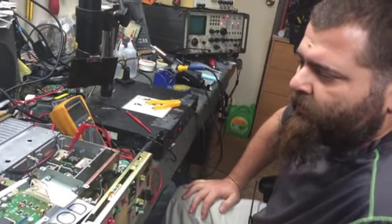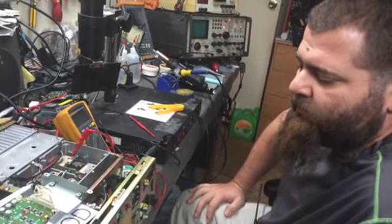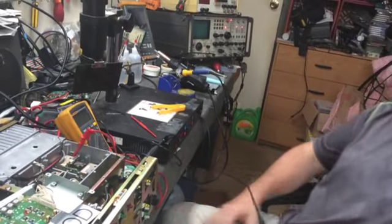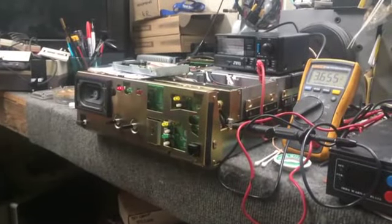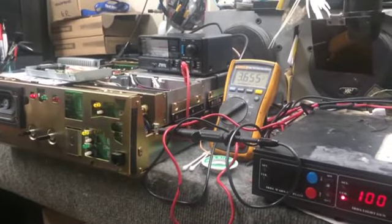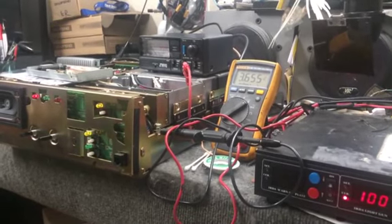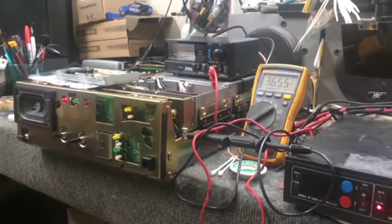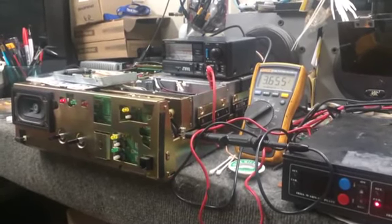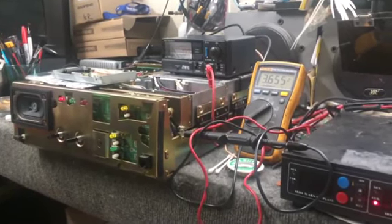We're going to go ahead and get the AllStar node and some little checks and balances done. But for the most part, it's ready to go into service. All right, we got everything. You can see the voltage over there. We're about 3.65. It'll creep up to 3.7 occasionally, which is fine because it's 4 volts plus or minus 0.5, so we're within spec of the unit. That is the transmit VCO you're looking at there.